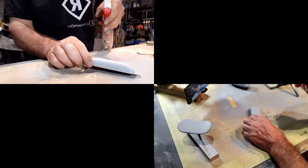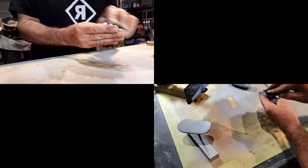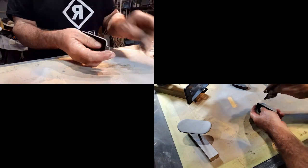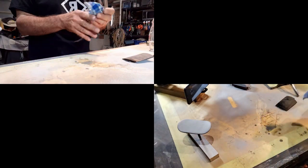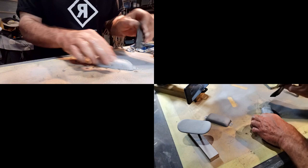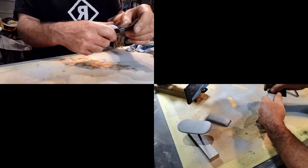Make sure you adopt a light touch when wet sanding, as it will be easy to sand through to the metal base. Reapply your primer or spray putty if this happens to you. The wet and dry sandpaper that I use here is 400 grit. There is no requirement to go to a higher grit level with the primer coat, as this may impact on the ability for the colour coat to successfully adhere to the piece.